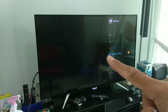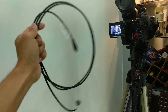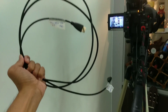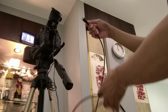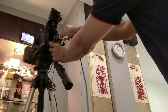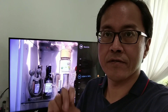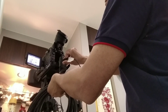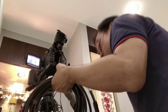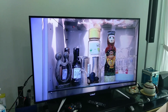Blank screen — it's not working. Now what if I shorten the camera end from 20 meters to a 2-meter HDMI cable? Yes, it works now and that's only 22 meters. Now let's try changing the camera end to a 10-meter cable. Yes, we have transmission and that's 30 meters.